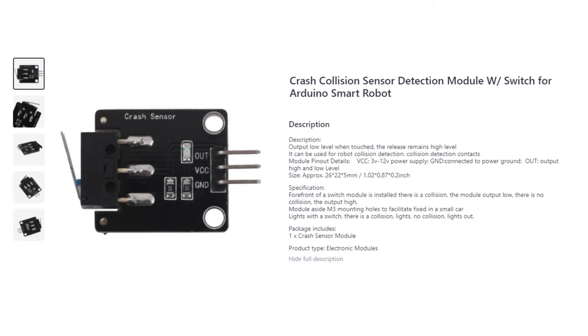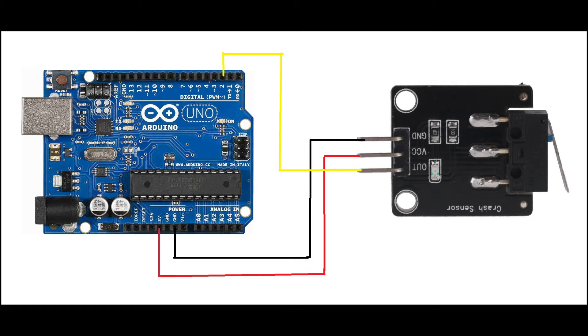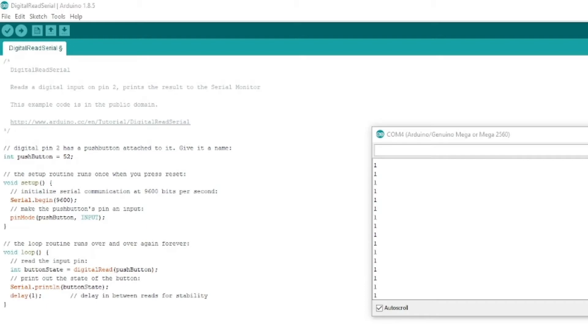It's a pretty straightforward and simple unit. It has screw holes if you need to fix it down to something — for example if it's attached to a robot bumping off walls you don't want it moving around. For the wiring, it's very simple: 5V to the VCC pin, ground to the ground pin, and the digital output from the sensor to a digital pin on the Arduino. You can put it into any of the digital pins, just make sure you code the pin correctly to match where you've connected the sensor.